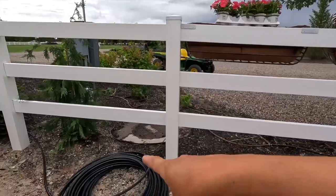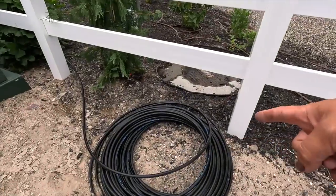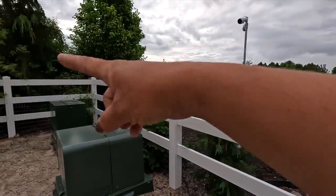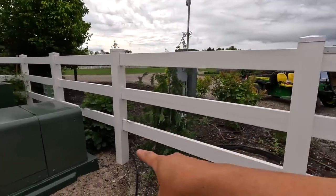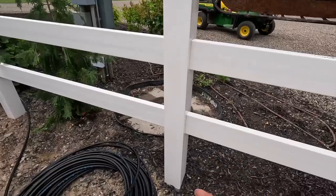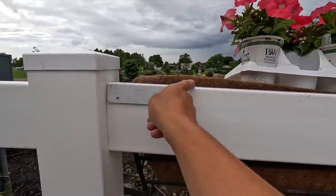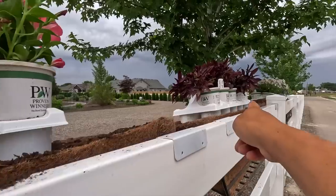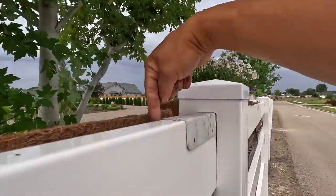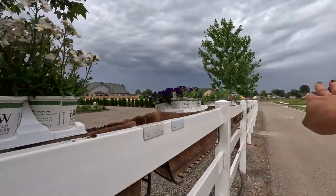And then they got this tubing, the poly tubing here, which is just 1/2-inch supply line right here. They got it attached to a zone, which is right underneath the shrubs over there. And what we'll do is, once we've got this all set, we're going to bring the poly here, and then we'll put an elbow coupler in, come straight up, and then another elbow coupler, and we'll run that black supply line all along the back side of all of these hay racks. So it'll come along here, it'll bump forward and then come around and then keep running the entire distance.